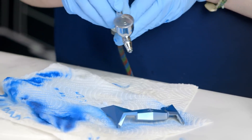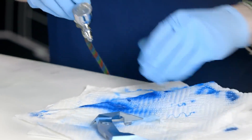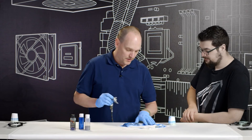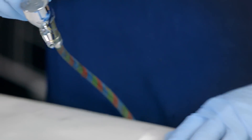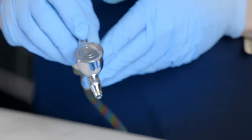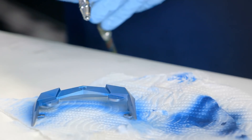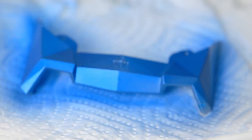It just slightly gets darker every single time. You could blast it, but then it's not going to adhere — it'll just roll off the surface. So just light coats, very light coats. It can tend to be tedious, but it's just one of those things that you can't rush.